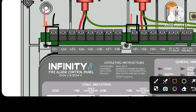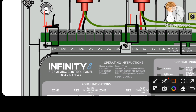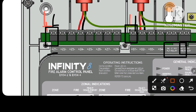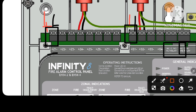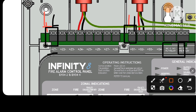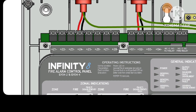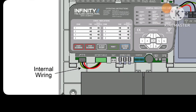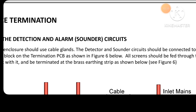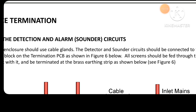These connections are for common relay connections — if you have to interface this with a smoke extraction fan, you can connect normally open and common, and in fire condition it will close and the fan will start. I already have a video on this panel. This video was specifically because one subscriber asked me about the termination of the manual call point. Thanks for watching.